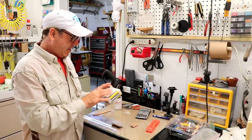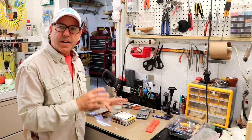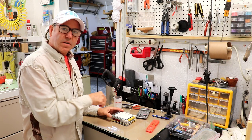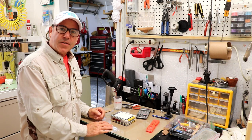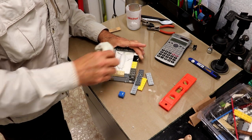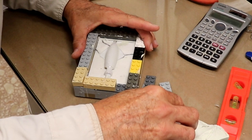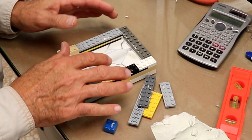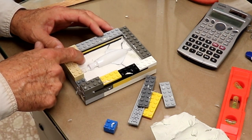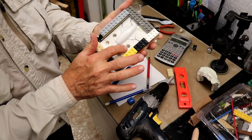It's the next day — this is set up pretty good, but it took me an hour or more to recover from that spill. I realized right after I poured this that I had forgotten to put in the alignment keys on the clay — those little indentures — so I'm gonna have to figure out a way to do it now. Let's pull this off. It looks good at the interface where the clay was; I don't see a lot of bubbles. I'm gonna have to build up the sprue again on this side and figure out how to put little holes in this silicone.